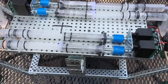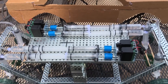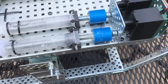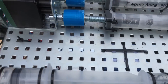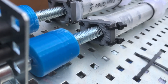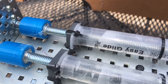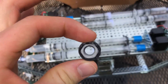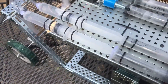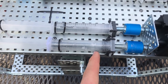Trying to convert the rotational turning of the motors into moving something in and out was pretty hard. At first I thought I was going to use rack and pinion gears, but I wasn't able to attach those to the build plate, and they would have taken up too much space anyway. I found a YouTube video of someone doing something similar with linear actuators, and learned that linear actuators exist and that'd be the easiest option. A linear actuator turns rotational motion into an in-and-out motion by screwing or unscrewing a bolt attached to the motor — there's a nut glued inside a hollow tube, and as the bolt turns right, it pulls the nut towards it; as it turns left, it pushes it away. Originally I tried gluing a 3D-printed circular nut casing to the walls of the syringe, but it kept slipping when being pushed forward, so I 3D-printed a second design with a lip built in to keep it from slipping. The syringe itself is a standard syringe with the hollow part of another syringe hot-glued to the plunger, so the bolt has extra room to move while keeping everything connected.